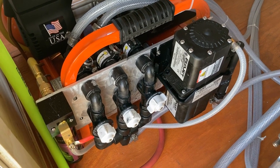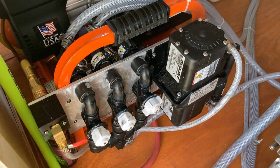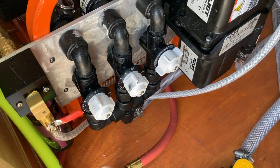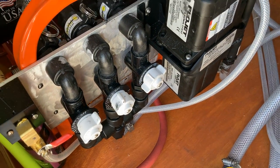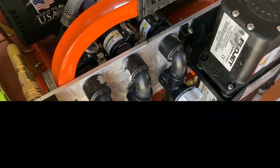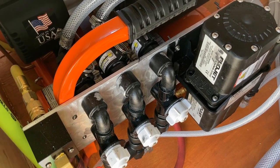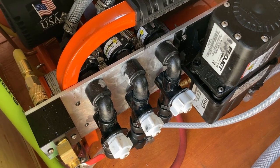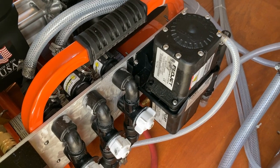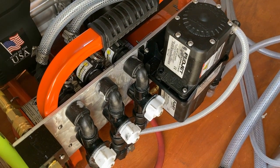When you're using just a two-valve system, the most important thing to remember is always eliminate the soap valve, not the water valve. I know a lot of people suggest you don't need to meter the water, but I've found it important — if I've got water all the way at five and bleach at five, that's about a 50/50 mix. Being able to turn the water down lets me go stronger if needed. The least important thing to meter is soap — I've just never found a reason for it.